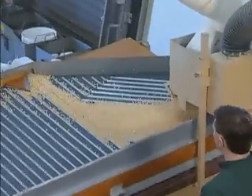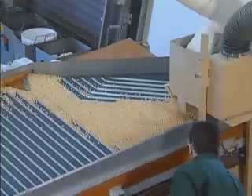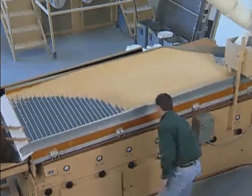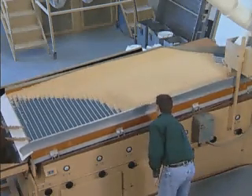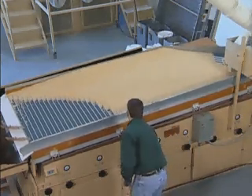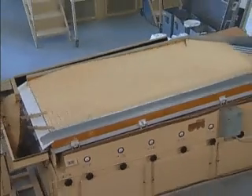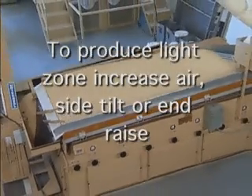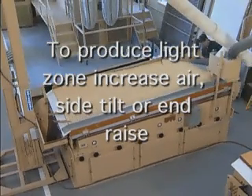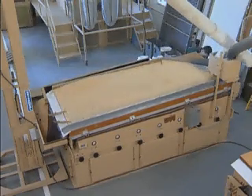Turn on the machine. Open the feed gate slightly. Then adjust the eccentric speed so material begins to flow up the deck. Wait until one half of the deck is covered with material. Adjust each air gate to provide just enough air to keep the material in a fluid state. Best results will be obtained by adjusting each air gate in succession, beginning at the feed end. If a light zone fails to appear, slightly increase the air, side tilt, or end raise. After the deck is covered completely, observe for a few minutes how the material is flowing, then readjust the controls to obtain the best possible separation.